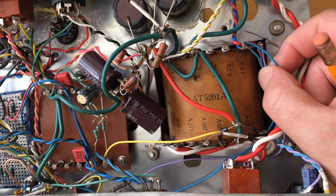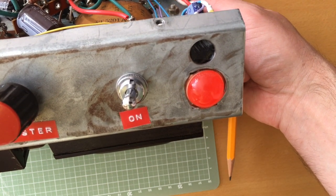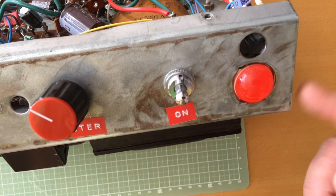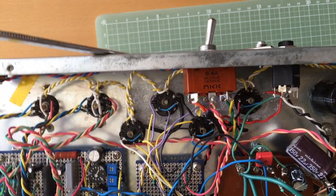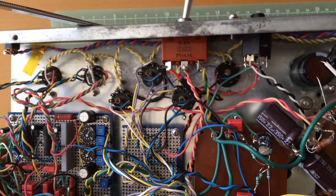These are the 5 volts rail of this power transformer. I use it to power on this side the LED. This LED, you might have seen it used in some pedals. It's a really funny part. You can connect it in several different ways, and actually to find the right way to connect is quite a challenge, but once you found it, it's a really cute LED. Anyway, here the 5 volts goes to here, and then it goes this way, the red and blue twisted wire, it goes to here. And that gives a 5 volts alternating current, which I use to power a fan.